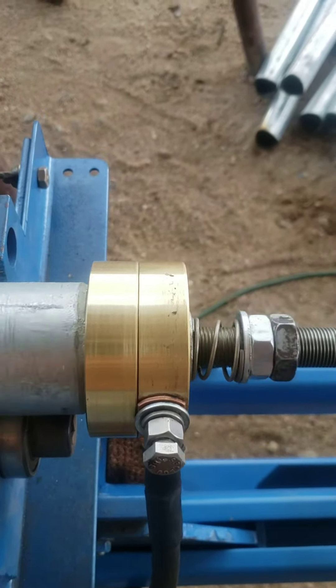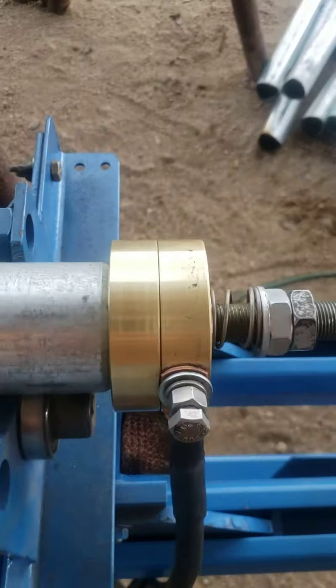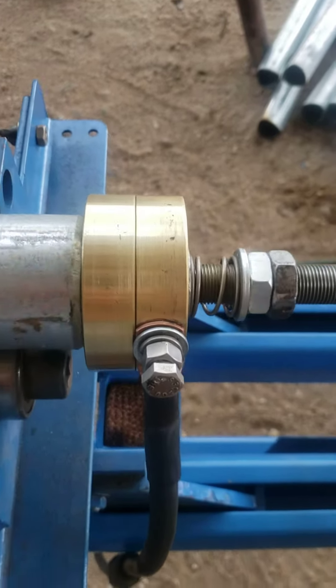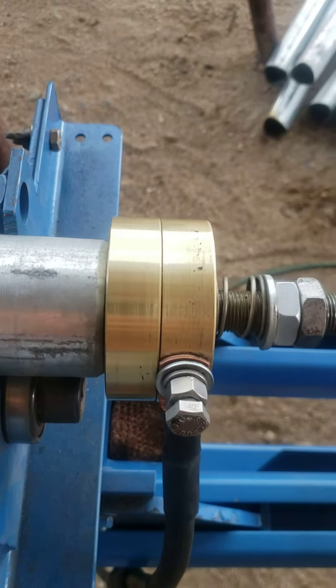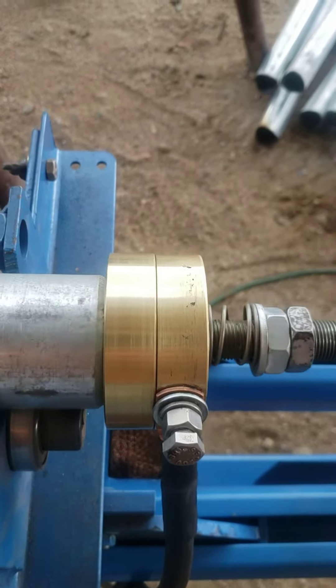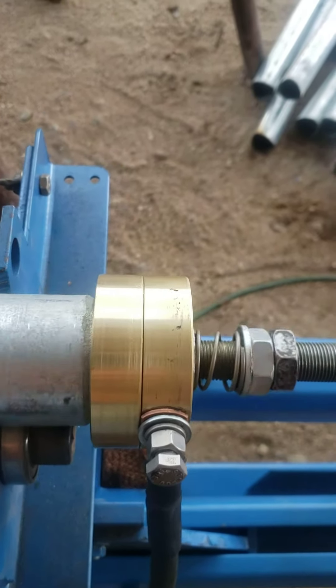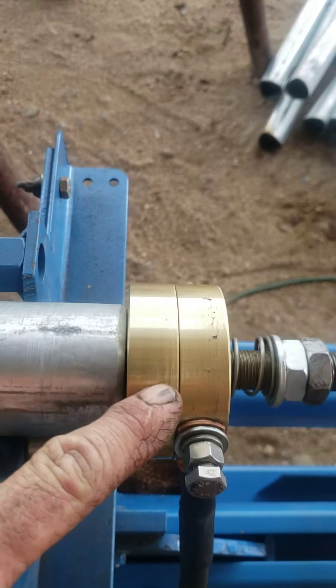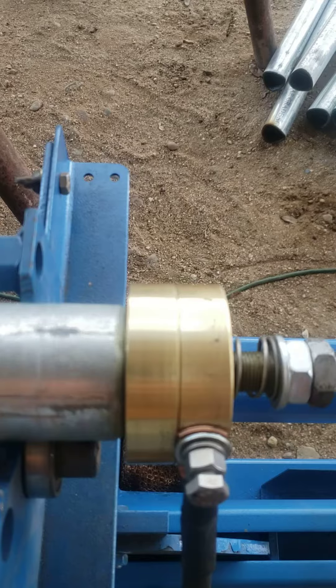I did actually cast this out of a bunch of old junk fittings, and it was nasty stuff. I don't know if I'll ever want to do that again. The main thing I did different was I'm primarily cutting pipe on this machine, and I ended up using an exhaust pipe expander on the inside to tighten up. I've still got to knurl this one so you can grab it by hand to make this thing tighten up properly, because it does loosen up.